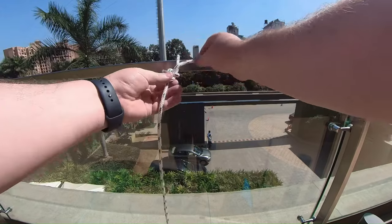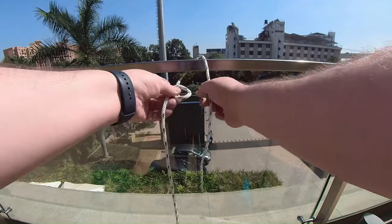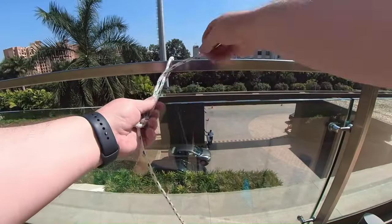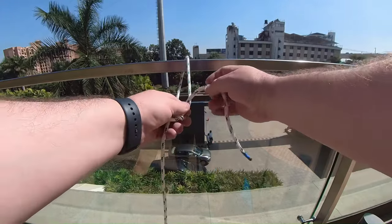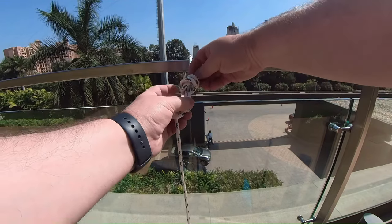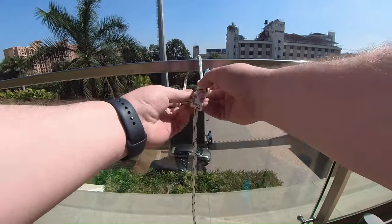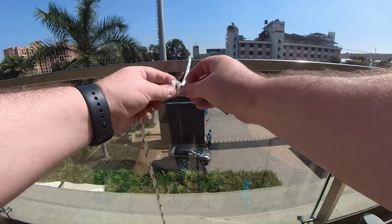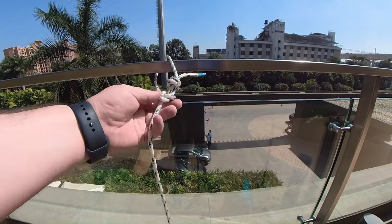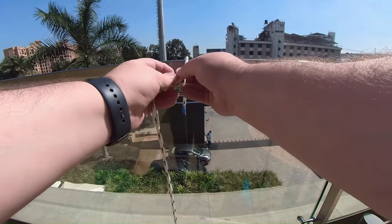Or you can give yourself a bit more line and re-tie it longer this time. You can do a fisherman's hitch — you go around once and then around twice, back on itself, behind itself, and then through. And that stopper knot will never come undone. It's a great way to secure it. You don't often need these on your jib sheets — I never do this on the jib sheet. But if I'm climbing to the top of the mast using a bowline with a climbing harness or a bosun's chair, I will put a stopper knot in there just for safety.